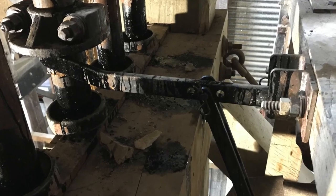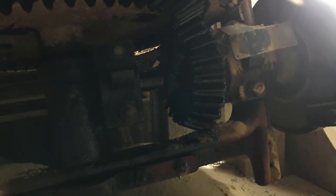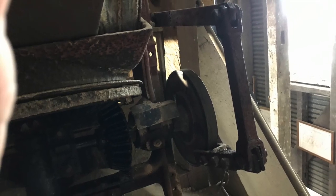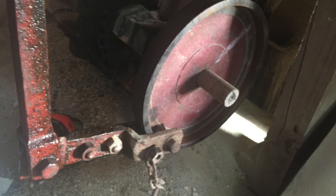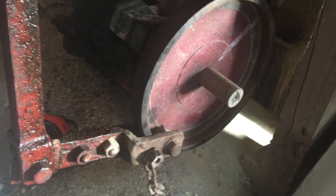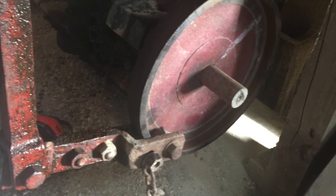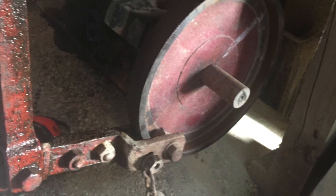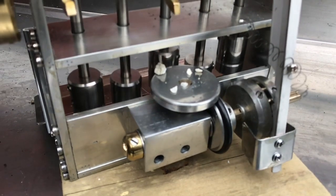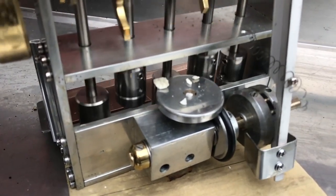This is a photo of an unusual ore feeder mechanism used in the big battery. It has a clutch or brake mechanism that connects onto the rim of a wheel as it rotates. Near the bottom it grips the rim, lifts it up until horizontal, then the brake shoe loses contact and it drops back down — a repeating motion. In my model I used a ratchet system instead, which gradually rotates the wheel around.